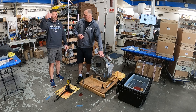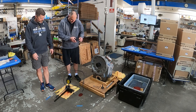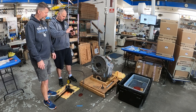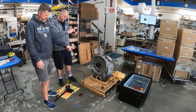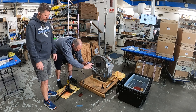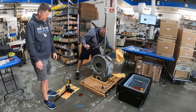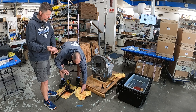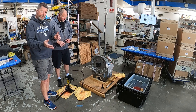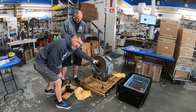So it's the 286 and anything above that is a pressed-on hub. This is a specific Vulcan hub, so if you're to incorporate a Vulcan torsional coupling that's going to bolt to the flywheel of the engine, there are actually two different sizes we work with. This is the smaller size. There's also a larger hub that accommodates what we call an E-type Vulcan coupling, which is a single-stage rubber block coupling. There are different styles — there are CENTA couplings that use the CFDS version with the four posts, so that hub would be pressed on. But at the end of the day, whether it's a two-stage coupling or a single-stage coupling, whatever interfaces with that coupling has to be pressed on to this input shaft.